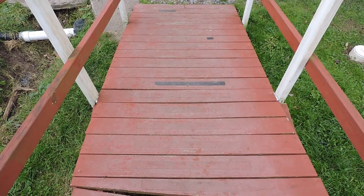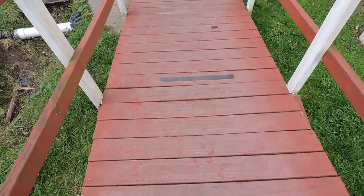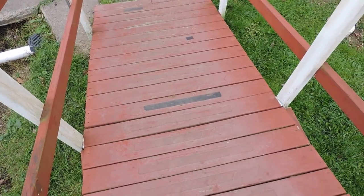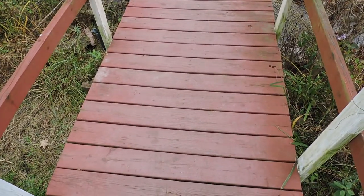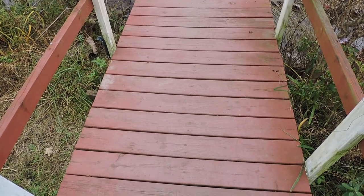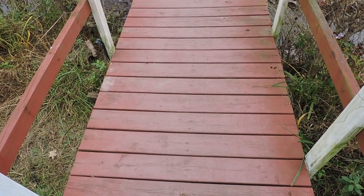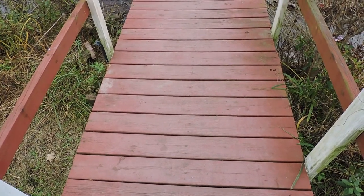I'm also planning to make it safer for walking. I will mix some sand in with my paint to give it more grit for extra traction. I've tried traction strips here with limited success, so I'm not going to just rely on them this year. I did one year buy special paint that was supposed to have abrasives in it — a deck and porch paint that cost three times as much as regular paint — but it didn't last any longer.